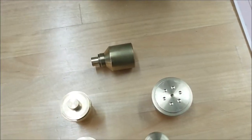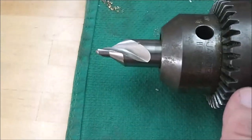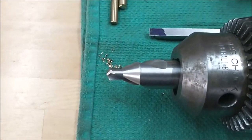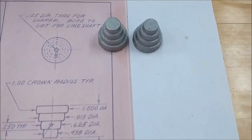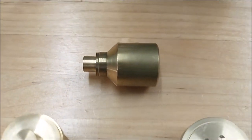This is extremely easy to make. It's even easier if you have a three-quarter inch center drill — just drill a piece of material, part it off, turn it down, and you've got one. I'm going to show you a way to do it if you don't have a three-quarter inch center drill or a monster chuck, and you may have a mini lathe. Let's knock one of these out real quick — probably the handiest thing you'll ever put in your toolbox.